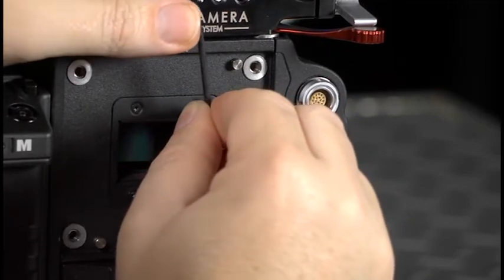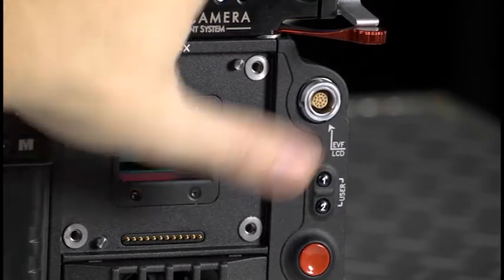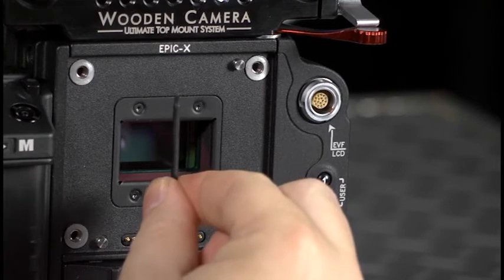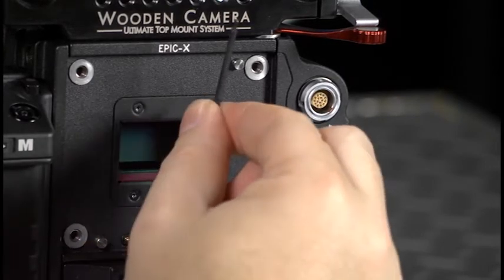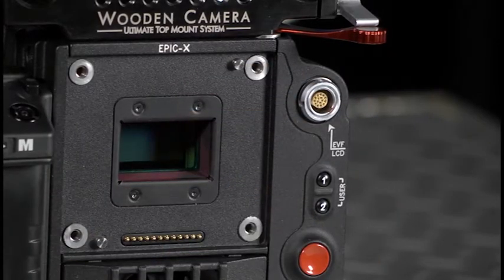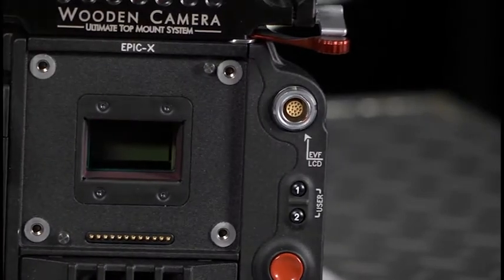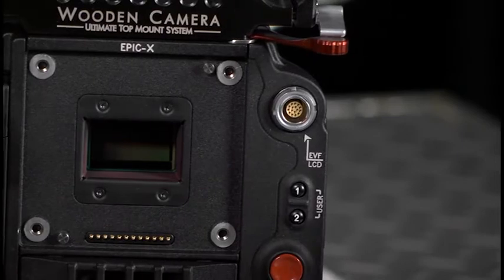Now, some of the screws aren't lining up, but you get the idea. It's the same distance. There. Now I have them torqued about right. If you do it from 12 o'clock noon, 1 o'clock is how much you want to torque each screw in a diagonal formation once it's finger tight. All right? So there you go. The new bushing's installed. A little air, get things off of it.